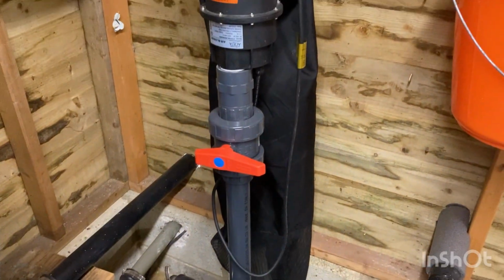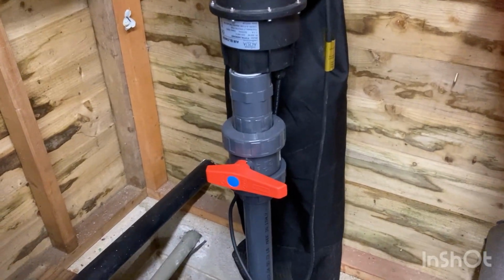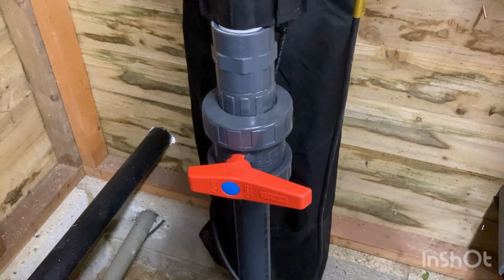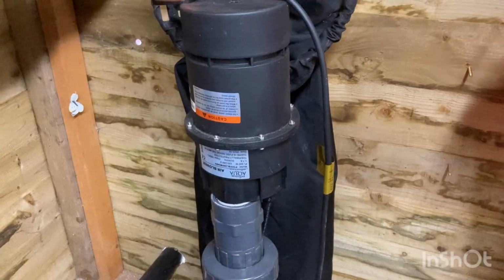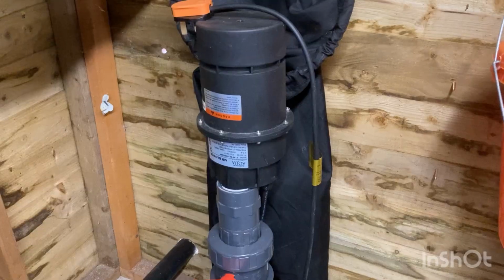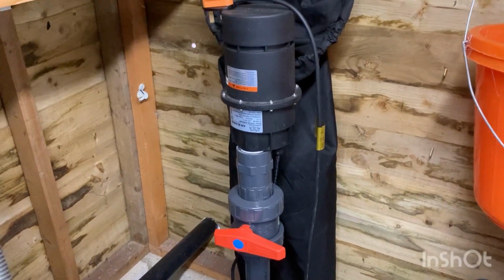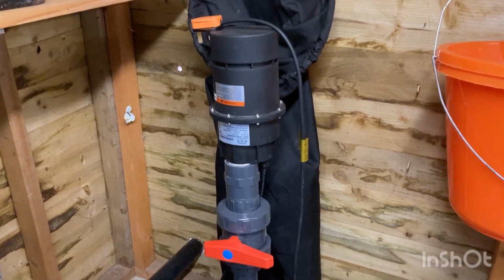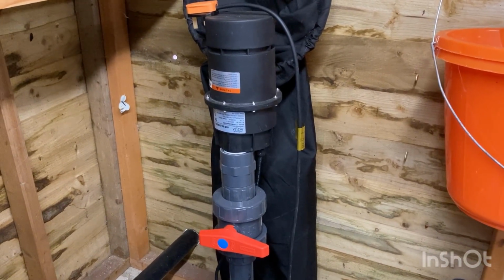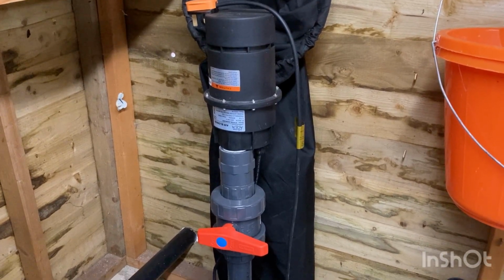One thing I will say though, you need to be very careful with is the blower. So you need to make sure when the blower isn't on that you have this valve shut. As if you turn the pump on, the water will come straight up this pipe and into the blower. And one particular evening when I was cleaning the filters, I forgot to shut that, and water did shoot up the pipe and into the blower, and so was shooting up these jets here, and it shorted out all the electrics in the shed. Thankfully I was quick enough at turning it off, and I managed to take the blower apart, set it in front of a dehumidifier for a couple of days and dry it out, and it now works again. But I think to replace these are over £100, so expensive mistake if you get it wrong.